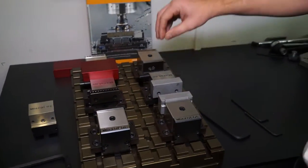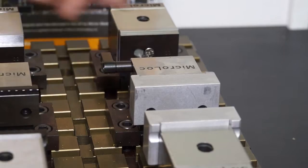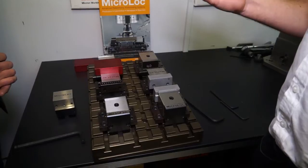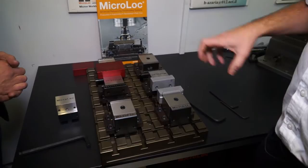So this is my location, and these jaws here — these are soft jaws, are they? They're soft jaws, yeah. We do them in aluminium and in steel. You obviously just profile them to suit your workpiece. So if I had an irregular shape, I could actually machine that profile in the soft jaw and then hold that component to it? That's right, yeah.